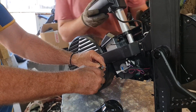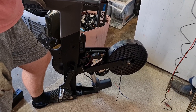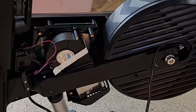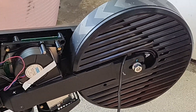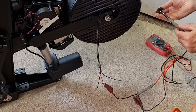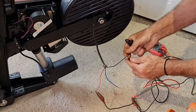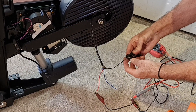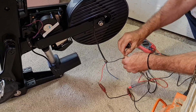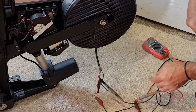It's blown — the bulb blew. We decided to move it from the top of the freezer to the floor; at current setting it is upside down, which will enable us to crank it and also clear the floor with the pedals. My father is setting up the voltmeter. As you saw in the last segment it blew the light bulb, so what we want to do now is test between two of the three phases to see how much voltage at arm crank we can get out of it. When it consumes voltage it's a 1.5 kilowatt motor, but we were able to get between 50 and about 63 volts out of it, which is pretty good considering we're only cranking with our arms.